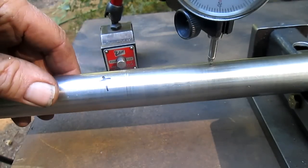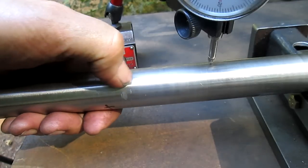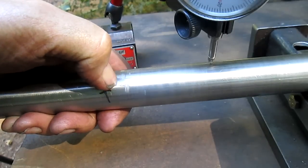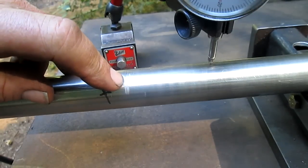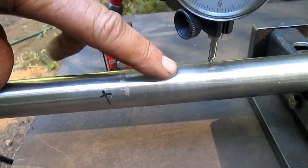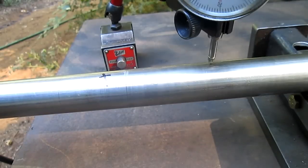So we're going to heat treat that. There's the point where we're going to heat it. But if you look back here just a little bit, you're going to see 3 or 4 little dings in this, which is weird because it isn't like a ding, it's just a funny spot. There might be 1/4 of a thousandth of a drop in that. The boat guy that brought this said that oftentimes people will stand on the shaft thinking it's good and strong, and of course it's very fragile. It's good and strong lengthways, but not across the grain.